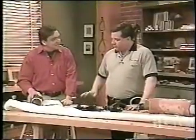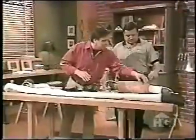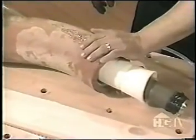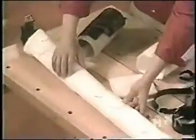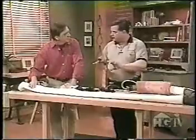How do you get this thing in there? First, we thoroughly TV-inspect the sewer to make sure there aren't any other problems. Then we slide a rope through the sewer, pull a cable back in, and winch the apparatus into the sewer. It looks like a bladder inside — it has a felt material in different sizes. That felt material is what becomes the new pipe. You wrap it around the bladder and it's held in place with little rubber bands. The epoxy is wetted out in a tub and worked into the felt bladder before it's inserted into the pipe.